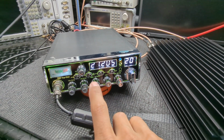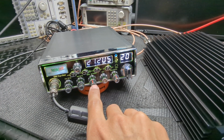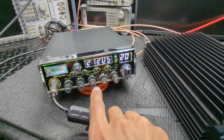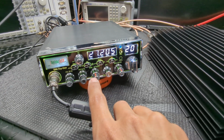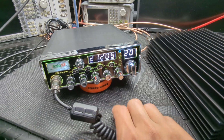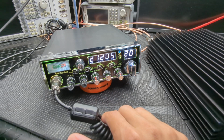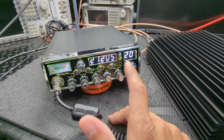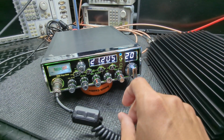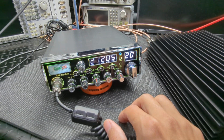And with this one, I haven't done a video on one of these in a while, these TRE Top Ones. What's really nice is that this gets put to an echo control, which is included with the tune alignment. Also, a MOSFET upgrade gets done with the tune alignment. So these actually come out to be pretty feature-packed and, I guess you could say, a good bang for the buck. Once you figure in that it does have the echo, and it's got the counter and everything built in, sideband radio, 30 plus watts. And it's the size of a 29. It's not the size of a DX959. It's a little bit smaller, so it fits in the cubbies. So it actually is a good all-around radio.